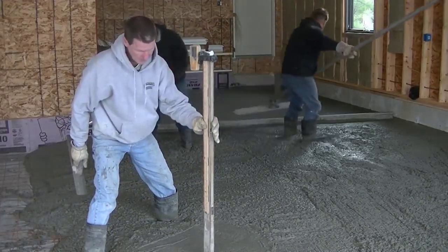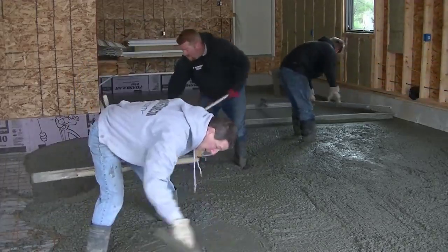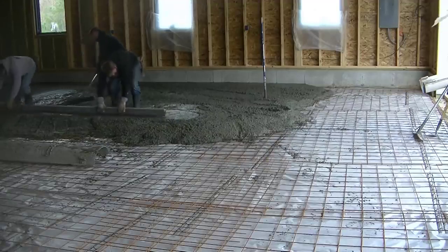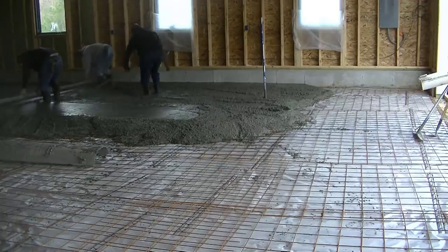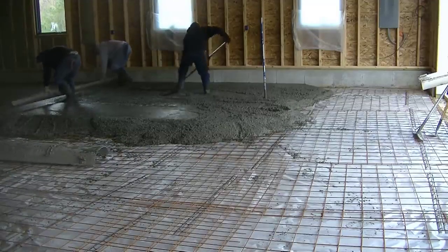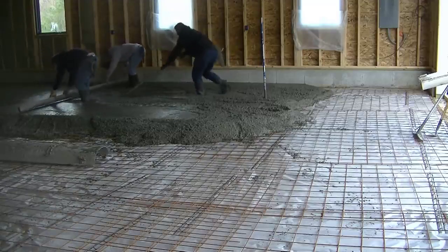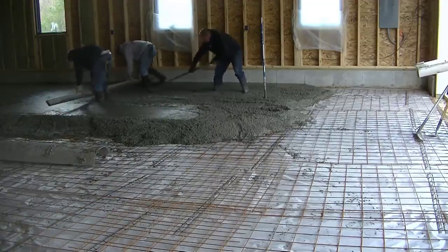So I'm shooting my pad with a self-leveling laser — it's the Topcon RL-H5B. All this stuff that we use will be down in the description in the video if you want to check them out. That's how we shoot our grades in the middle of these floors: we just make a wet pad like that, and I put an X on it when I know it's right to grade. Then we'll strike our pads to screed off from.